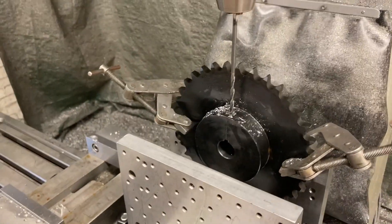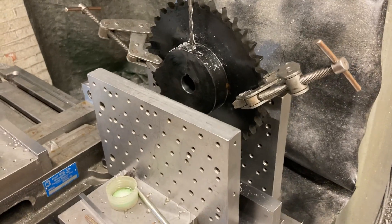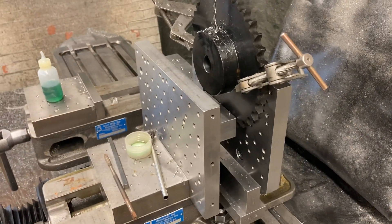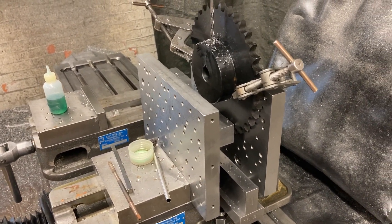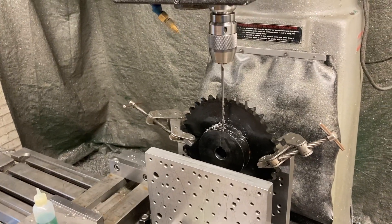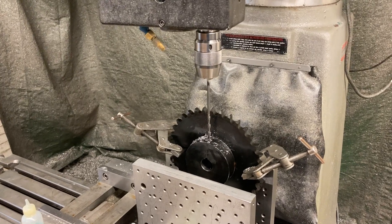That's how I set this up — set up the sprocket to do side holes for set screws. You could clamp it on a knee, but it's easy to work with the vise. I just screw those things on, I don't have to break up my setup — take the big plates off, put the regular vise jaws back on, and I'm back doing other stuff. Signing off for today, thank you for watching — please subscribe.